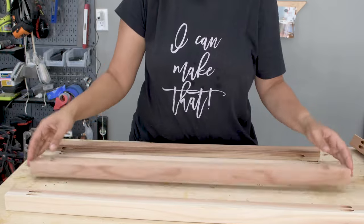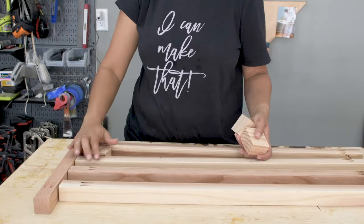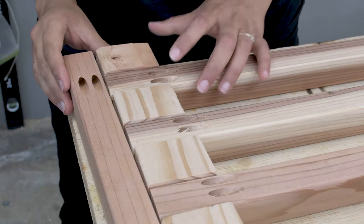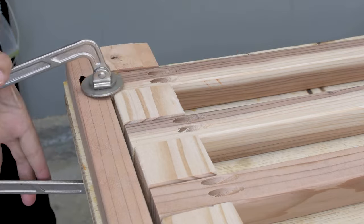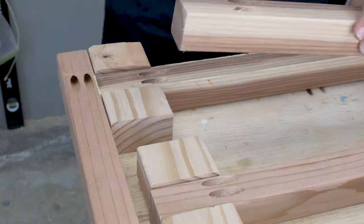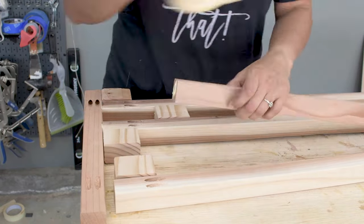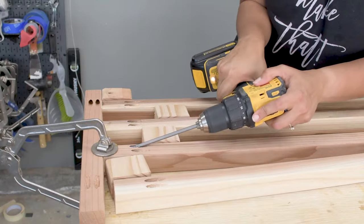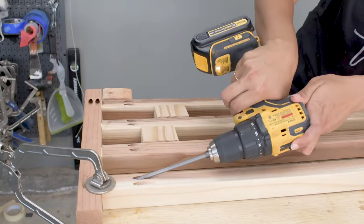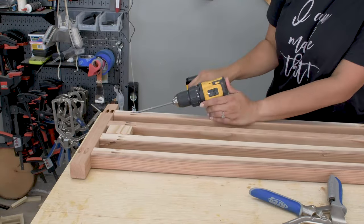Now to assemble, I started with the shelf. The shelf flat spacing is two inches, and to make things a little bit easier, I used a scrap two-by-three and cut it up into two-inch pieces and used them as spacers. This made the entire process so much easier. To attach, I am using two-inch exterior-grade pocket hole screws — these are the blue-coated pocket hole screws. The last time I built it, I actually added two shelves, but I found that we rarely used both and just one shelf was good enough to dry anything that needed to lay flat or to store extra towels. So this time, I built just one shelf.